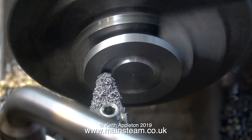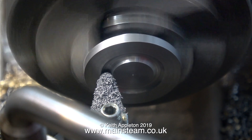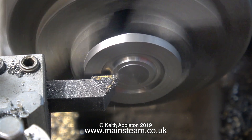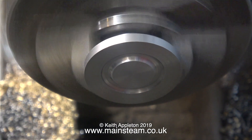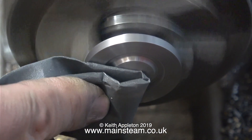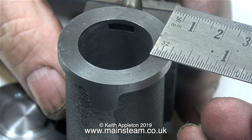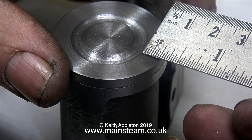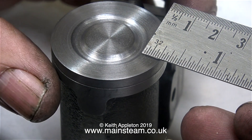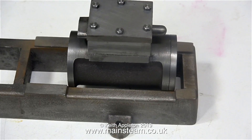I have to make sure the center part is one inch in diameter — not an interference fit, but a piston fit in the end of the cylinder. The next part of the job is to use a round nose tool to make a recess between the center part and the outer part, but it's very important not to take too much off the outer diameter. At this stage I could make a mark on the flange, then later mark it out for the hole positions. I left the flange at the end of the cylinder at 5/16 of an inch, so if I make the flange on the cover 5/16 of an inch and drill holes exactly in between — which is 5/32 of an inch — everything should work out okay.